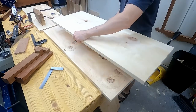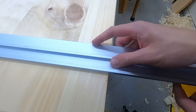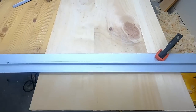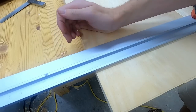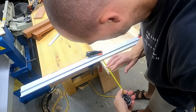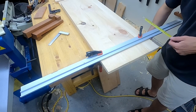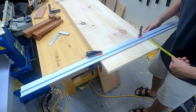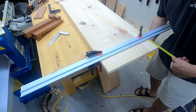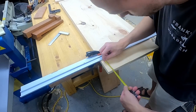I mark exactly three and a half inches from that line at the top of the board and at the bottom. I try to get these as accurate as I can by eye and then we'll adjust it in just a minute. Next, I flip the board around so that line will be overhanging the bench top and I'm using this straight edge guide. You could use a piece of plywood, a straight piece of wood or whatever else you want, and sneak it right up to those marked dots. Before doing anything else, you want to verify that that straight edge is 90 degrees to the reference edge. You could use a square, or what I do is just take a tape measure and make sure that it's exactly the same distance from the cut line.